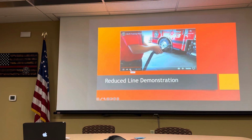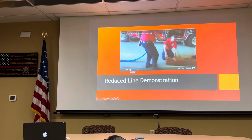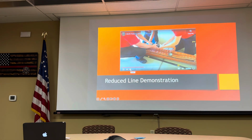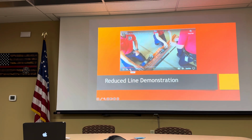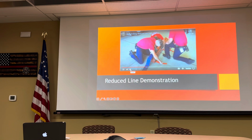Attach an inline valve, which will reduce 2.5 inch hose down to the 1.75 inch hand line. Attach the valve to the female coupling on the skid load. Attach a nozzle to the male hose coupling. 3 seatbelt straps will be used to secure the load. Position them under the layered hose.